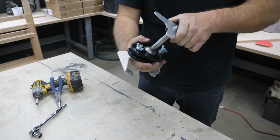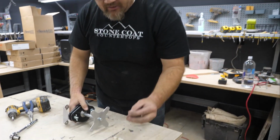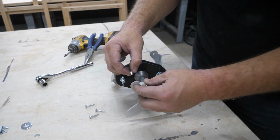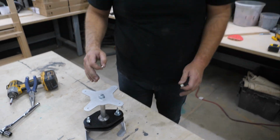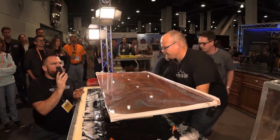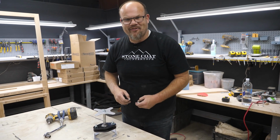Okay. I've got the tilt table well on its way to assembly. The next thing we're going to do is use our spacers and the screws to make sure that we can hold our piece in place. These are optional. There's a couple of things you can do here. You can add a piece of wood to make a bigger footprint, or you can use our spacers and screws and use this footprint. Either work fine. It's just your preference. Let me show you how to do this.